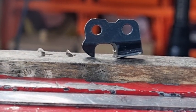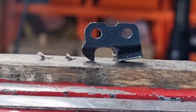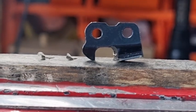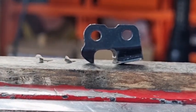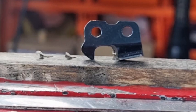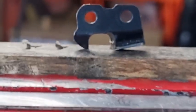Really, I can't see anything at all. You'd have to have an extremely bad gullet on round filing before it causes issues. The chips and all the fine sawdust exit through what they call the chip channel underneath the top plate. I think you can clearly see that the gullet really doesn't play a major part in it.